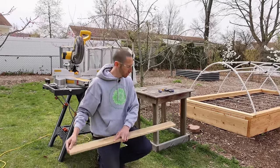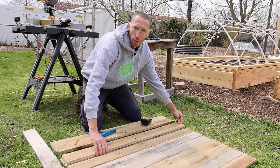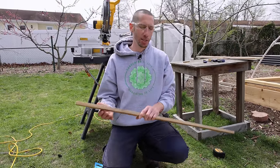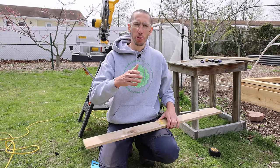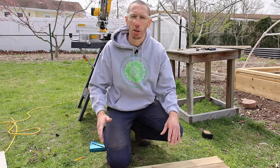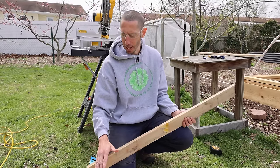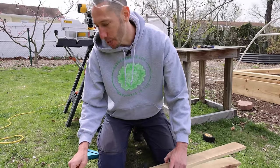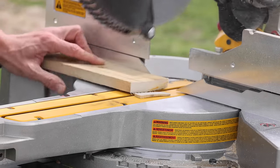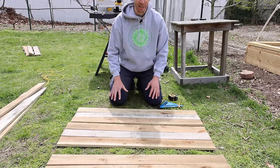This one's all cut. Now I'm going to use this board as a template for all the other ones so they're all exactly the same length — I don't have to measure anymore. After marking all of these, I realized to make up the frame of my actual bed I'm only going to need nine pieces: three in the front, three in the back, and the other three will be cut in half to make up the two ends. I just need to pick out my best nine pieces and the rest will be used for braces. I've already got two cut. I selected my best nine and have them all marked using the template.